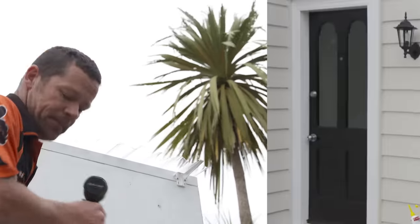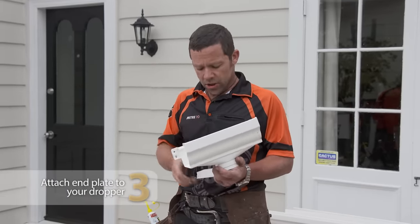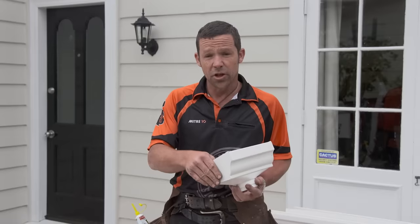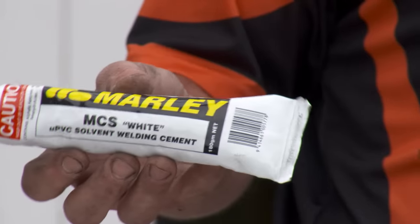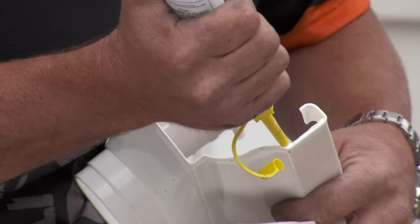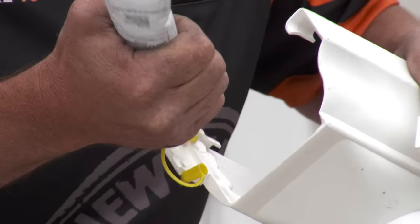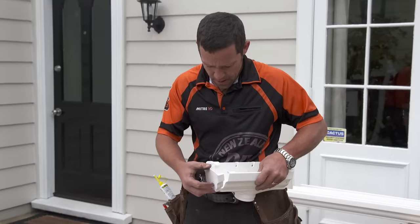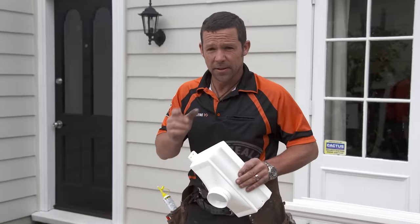Now I'm just going to sort out the low point. This is my dropper. Before I jump up and screw that to my beam, I want to attach my end plate to the back end of it because it's going to be very hard to do later. To do that, I'm using PVC solvent welding cement. I'm just going to apply the welding cement to the inside of the dropper, applying a liberal amount, and then just pushing the end plate in. We'll just wait for a couple of minutes and that'll be set.